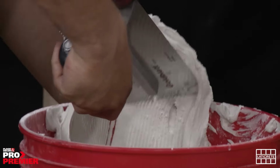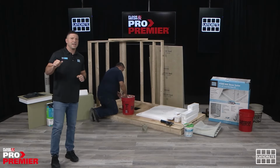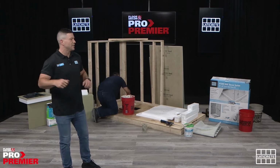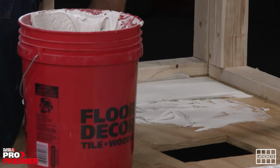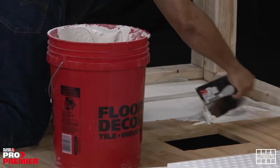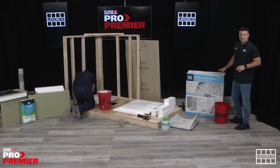So you're gonna see Adrian get started here in a minute. The key is keying that mortar into the substrate. We wanna get a good base coat. So once he's able to spread and ultimately attach the pan, we have good consistent coverage throughout. So while he's doing that, I'll give you some background on the shower kit system.